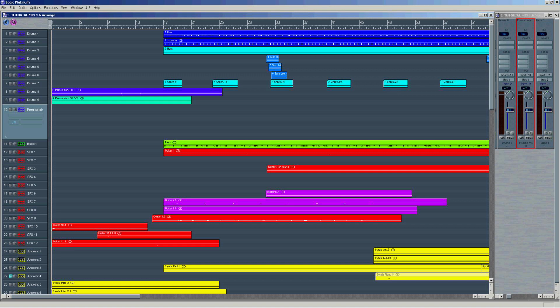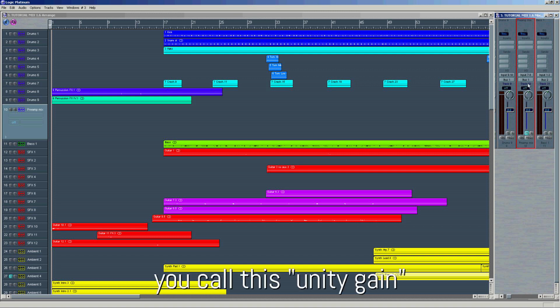And what we can do is set the input for the preamp and set it to mute, because otherwise you will listen again to the same sound. You could use channel 3 and 4 to monitor the sound, but I'm doing this simple. I have set my preamp to a 0 dB level, so a 0 dB level output of the sound card means a 0 dB level input from the preamp. So I'm not afraid of peaks because there is lots of headroom in this track, and I'm just going to set it to record, and we just have to play and listen.